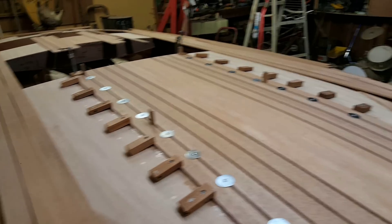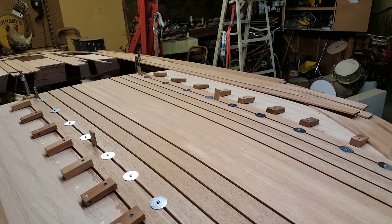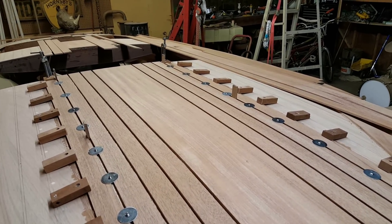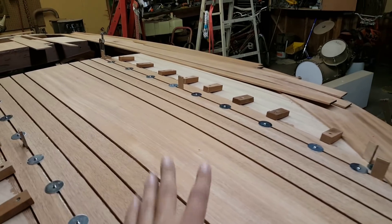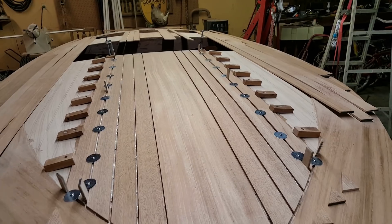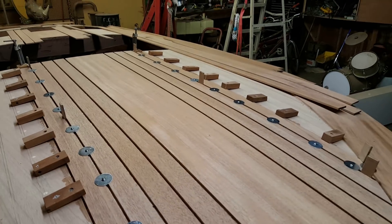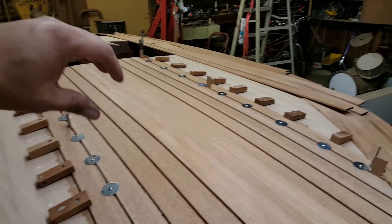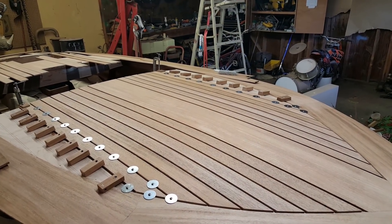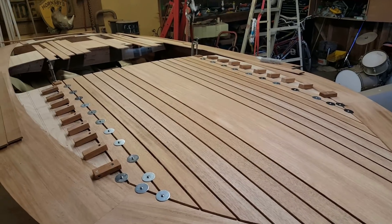As a rule, what's worked really well for me is that for every eight-inch-wide by 20-inch-long length it takes roughly one ounce of epoxy to glue down. I'm using that same formula to figure out how much epoxy I need for each plank. So far each pair of planks has taken about one and a half ounces. As I get out toward the shorter ones it'll take less and less, but I'm still using that same formula. We just glued on the 13th and 14th deck plank up in the bow — it's turning out really, really nice. Same formula: two a night.